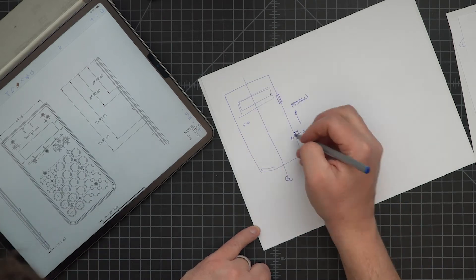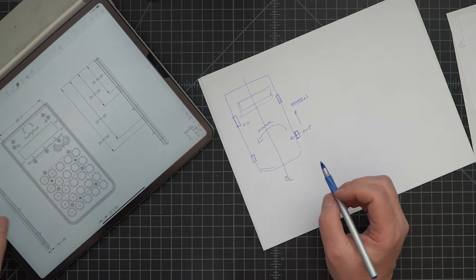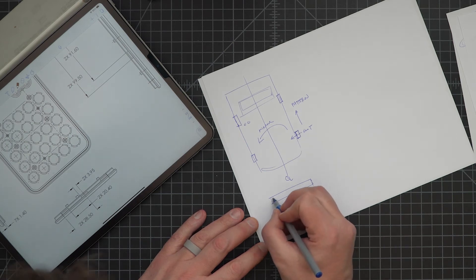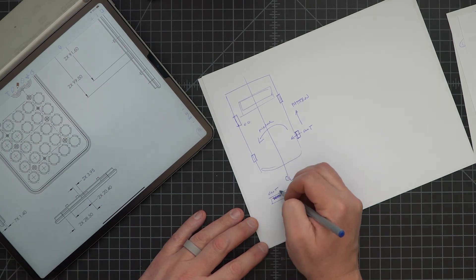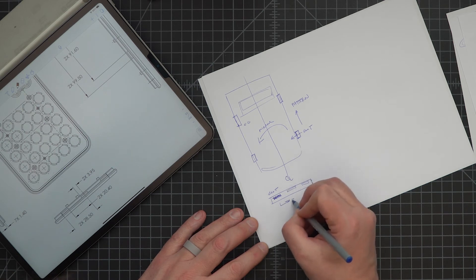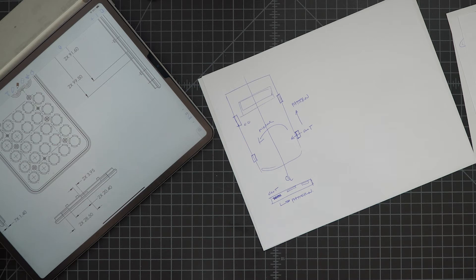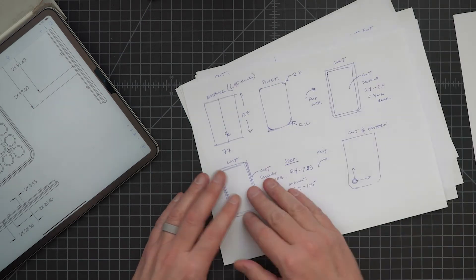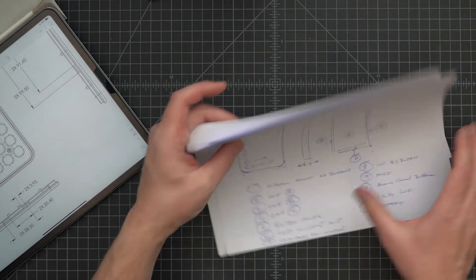Step 20: create the slots around the side of the front cover — do this just on one side and then mirror it across the right plane. These slots are used to hold the front and back cover together with snaps. Step 21, the last step: create the slots on the bottom of the calculator by making one slot cut and then patterning. Before I even opened up the CAD system, I had a very good idea of what needed to be done. I came to that understanding by reading and visualizing the drawings, breaking the complex part into simple parts, and sketching out how to do those simple parts — that is the CAD strategy.